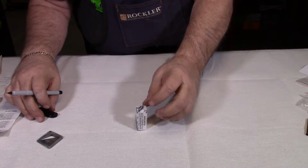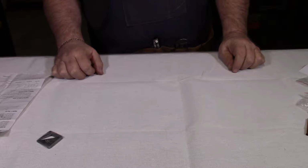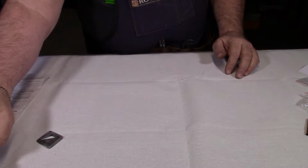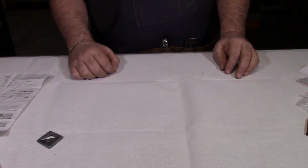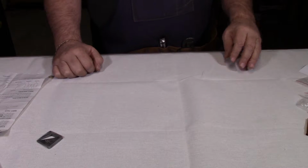That's where you line up your drill bit when you get to the drill press to drill the hole through the body. Also, you're going to need a 7mm drill bit for drilling through these blanks. The type of drill bit you want to use, if you're using wood, is a brad point drill bit. If you're going to be drilling acrylics like these I did here, you're going to want to use an acrylic drill bit. And acrylic drill bits are quite different than the wooden drill bits. If you use a wooden drill bit with these acrylics, you're going to likely ruin the piece, crack it, and blow it out. So it's a lot better to have the acrylic bit if you're going to do that.